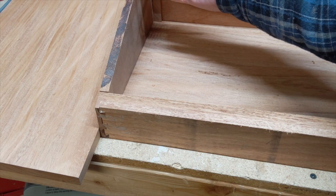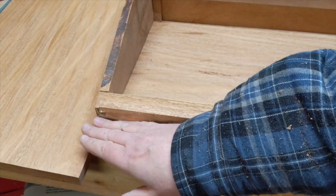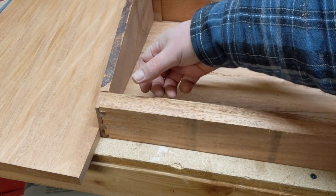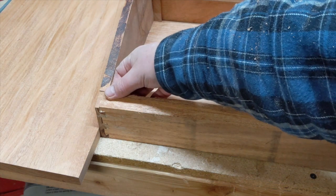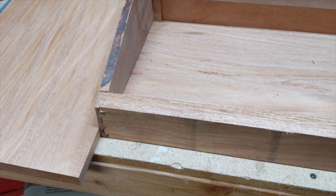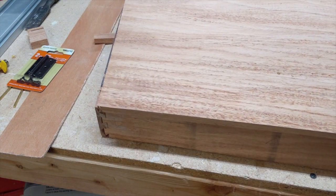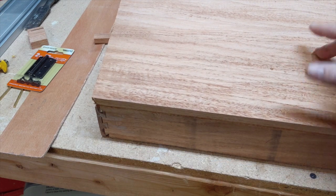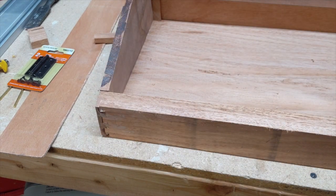You may remember when I cut this angle I came down and then flat. That made it easier to cut the dovetails, but it doesn't work well for the tabletop. In the previous step I glued a piece all the way across here, then I got this angle — which was 19 degrees — and ripped it all the way across the front. Now the table is flush all the way up, which makes it easier for this door to open and sit properly. So that's done.